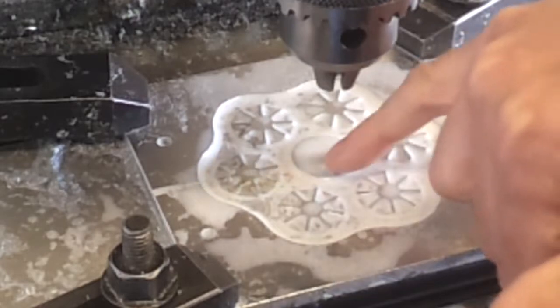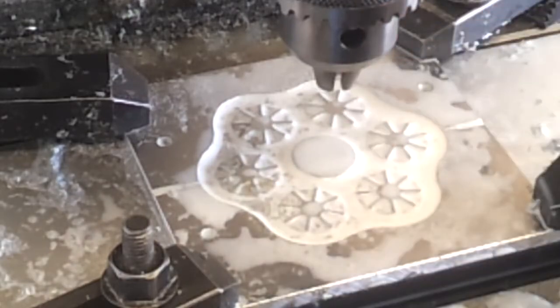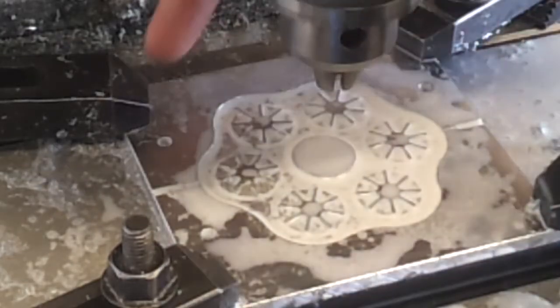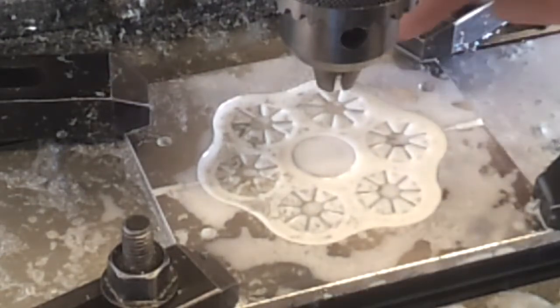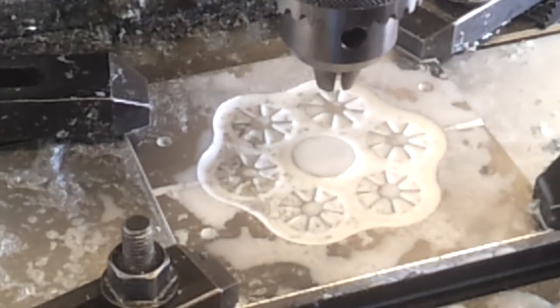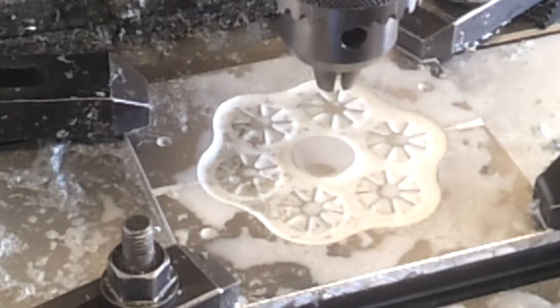So once I've cut that, we're about ready to index the plate across and add the final bolt holes that I need, and probably I'll add a couple of extra vents around the edges just in case. But very nearly complete, so I'll get set up and do the gates, and then the little feed well in the centre. I think that's everything, apart from just shuffling it across.